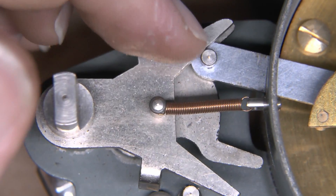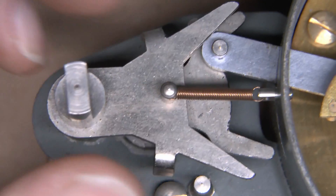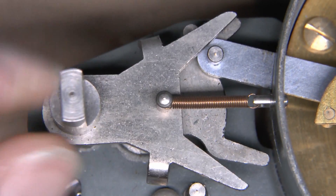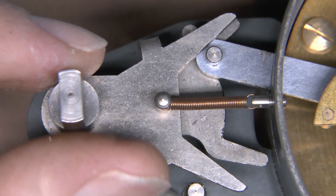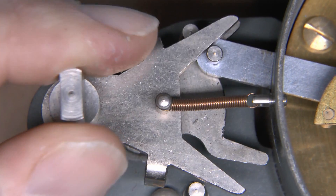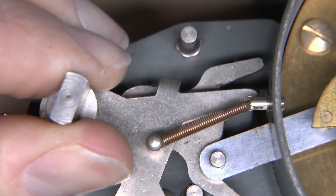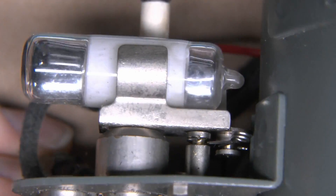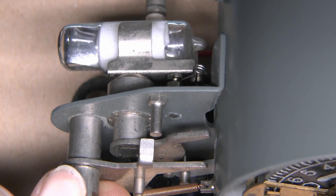Here's the switching arrangement. The bar here is actually from the timer, just over to the right, and it moves either to the upper or lower position depending on which of the on or off sections is being used. The manual set is simply from this lever - just a question of turning it to the on and off position as required. There's a little spring there to return it to the mid position. What it's doing is moving that piece on the back to tilt the mercury tube to the appropriate angle. So that's the off position and then the on position.